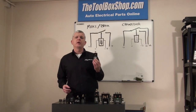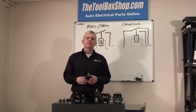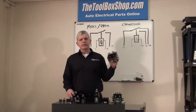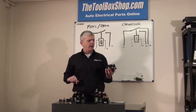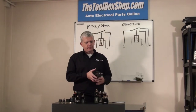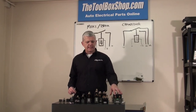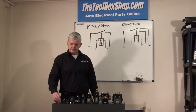In front of us we have the SW180 series. We could be using this for a line contactor or hydraulic contactor. If we were going to be using it for motor reversing, we would possibly move away from this and move on to what we call a strapped pair. A strapped pair is two that are joined together, used for motor reversing — forward and reverse — on a DC electric motor. The later versions of these are the DC 182, DC 66 — very small form — and motor reversing solenoids. There's also a DC 88 in between, which is a compact motor reversing solenoid.